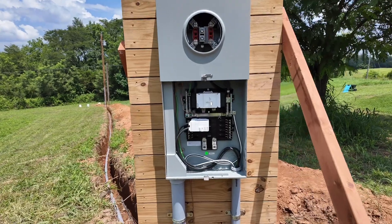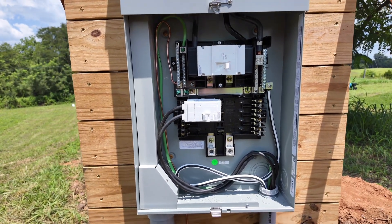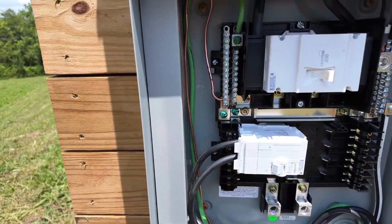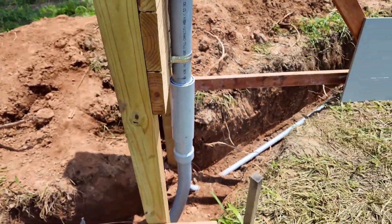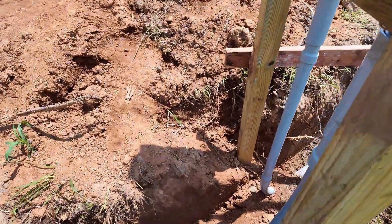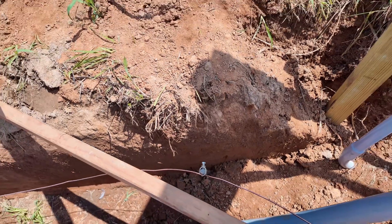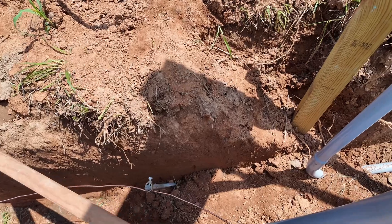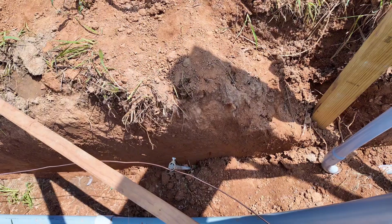Just wanted to give you a little update — I got everything wired in for the rest of the panel box. One thing I was working on was getting this ground wire in. I got that run down in the back here. I decided, in case I'm going to do any digging in the front in the future — like for a garage or the house — I didn't want the ground wire in the way. They said it was acceptable with code to put the ground bars in the ditch. You can even slightly angle them, I think up to 45 degrees. I only slanted it about 10 degrees, but that helped since the ditch is about 32 inches deep.